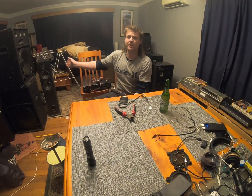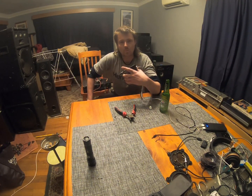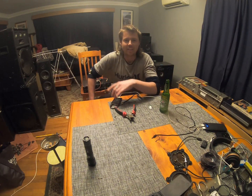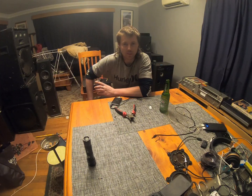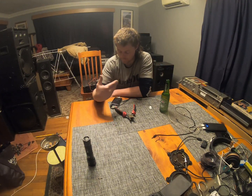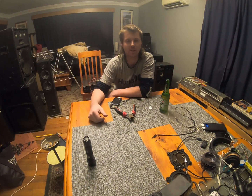So I think maybe the tweeters are blowing, but then I put my ear up to them and I can hear the tweeters going. I've done some Googling, and the R50 specs, they're 8 ohm speakers at 150 watts, 90 decibel sensitivity. I put my multimeter on those ones and I'm getting 4 ohms out of them.